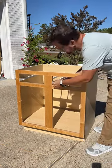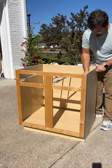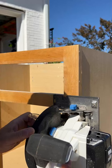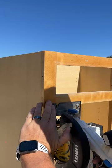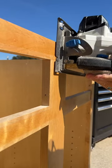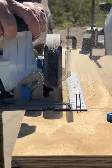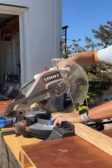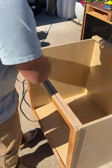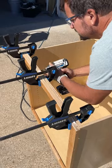These old cabinets are builder-grade garbage, but from this golden turd I created a glorious new cabinet. First, I removed the old trim pieces and the rickety old drawer slides. Then I cut the center stile and cross piece to create a big open box. This cabinet would need to support more than just a bad stain job, so I reinforced the carcass — made of nothing more than cheap particle board and wishful thinking — cutting strips and triangles of three-quarter inch plywood, attached with construction adhesive and countersunk screws.